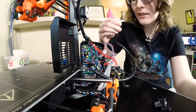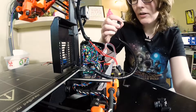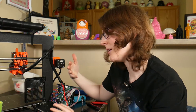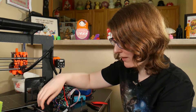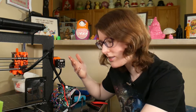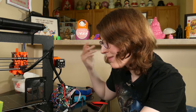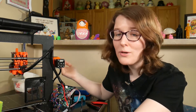I think that makes the most sense because it looks like this probably happened over time — I don't think it was all at once, because the plastic looks like it melted, then hardened, then melted and hardened again. And it actually matches a timeline, because about a month ago I redid the strain relief for the heated bed because of all the discussion on Marlin firmware. But I admittedly haven't checked the connectors on the board since I built the printer — that's not good. You should do that. I'm sure most people don't, but you should.